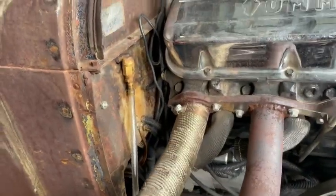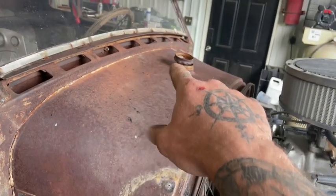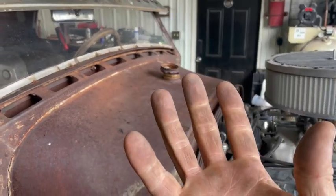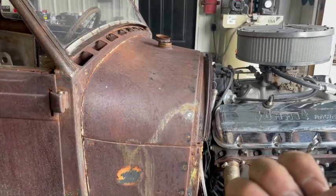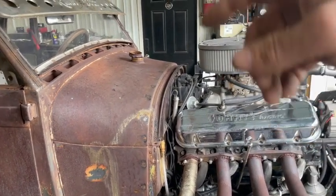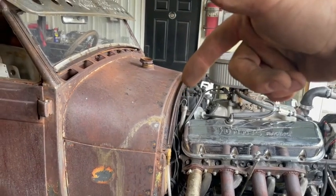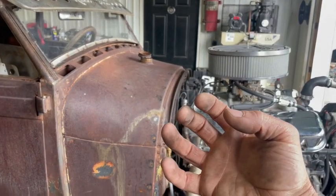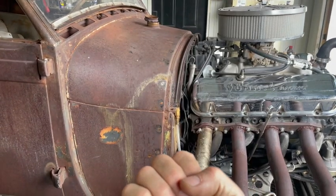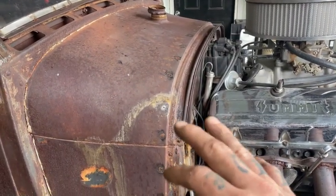All I did — argon is heavier than air, so we're putting argon right directly in the bottom of the tank and we're going to let that fill up and evacuate all the air out the top. I have it partially covered so it'll hold in there a little better — it'll evacuate all the oxygen, fumes, and everything else, because when it comes to gas, your fumes are going to be what's explosive. If this was a smaller tank, you could put a steam cleaner in it — the water vapor that's created by the steam attaches itself to the gas vapor and brings it down so you can drain it out. It really helps clean up the tank nicely, but we've got too much volume here for that to be really effective, so this is going to be our best method.